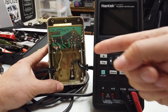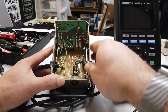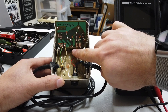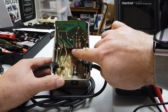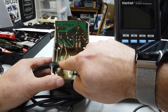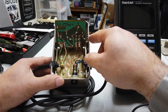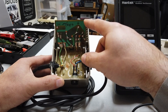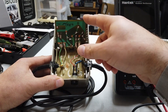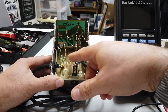Having done some research, it appears these devices are 'death adapters.' What happens is the regulator IC gives up the ghost and doesn't fail safe — it actually dumps the entire contents of the bridge rectifier and capacitor straight out on the DC terminals. So there is a high risk of quite a lot of damage to the Commodore VIC-20, because we should have 5 volts out of here but instead we've got 12 volts DC. That really sucks. There might be some chips blown in the VIC-20 — we'll find that out later.